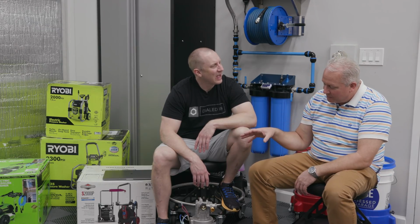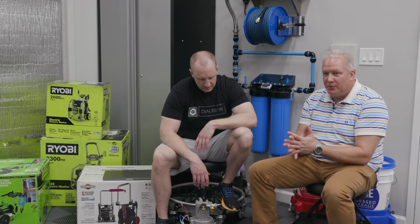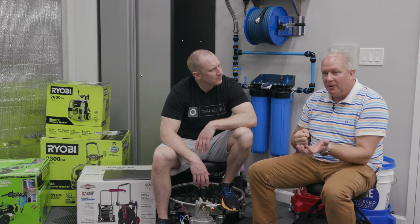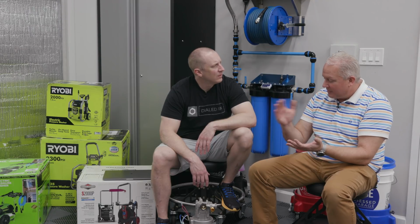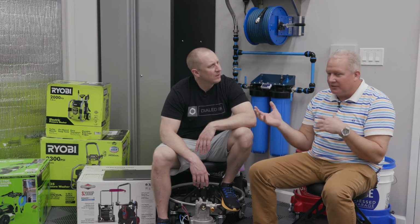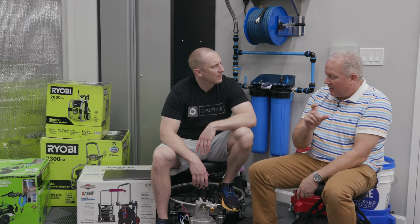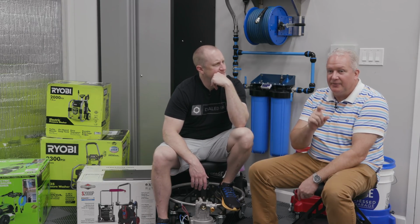All right. But so it's a minimum of 2 hours. Okay. So typically between 2 hours and 5 hours, you're doing your break-in period. The break-in period, they're doing a 20-10 cycle. And what that means is it's 20 seconds in spray mode and then 10 seconds in non-spray mode, right? So you actually want to cycle this thing. You want the unloader or the TSS switch to be working and going through that cycling. So you basically start taking your actual readings. And for electric and gas pressure washers, the test is a 30-minute test, and you're taking a reading every 5 minutes.